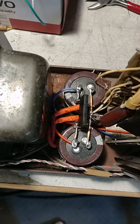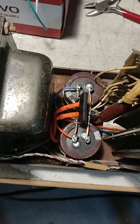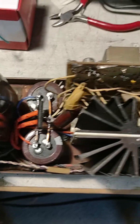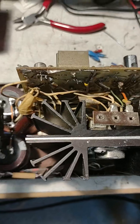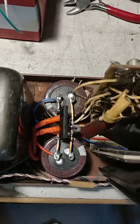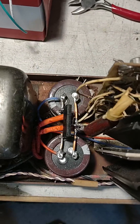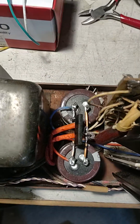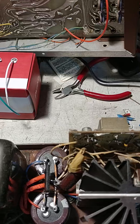I did such a good job insulating the diodes, it's hard to pick through them with an ohmmeter. I'm 95% sure at this point — I can run it for a while and I don't develop any hotspots on the diodes. A shorted diode is the only thing that could really explain a low voltage on this side. With no load and the fuses pulled, even a blown open diode — one of the four diodes open — the voltage would eventually float up to normal without a load. And it doesn't do that.